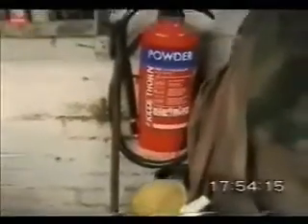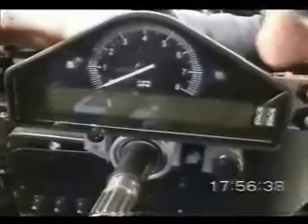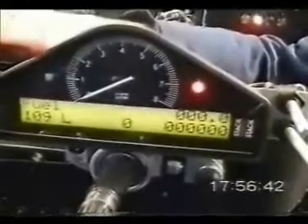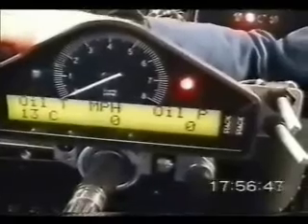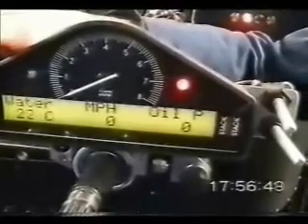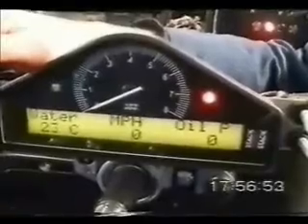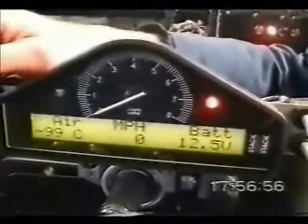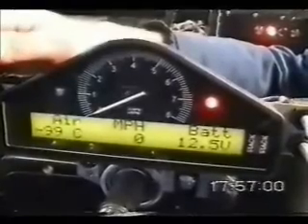I think we should be ready. We've got oil temperature 13 degrees C, water at 23-22 degrees — that's because I put hot water in. Oil pressure obviously at zero, so it's not running. Air temperature I haven't got connected. Battery's 12 and a half volts, which is okay.